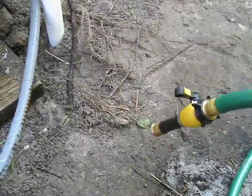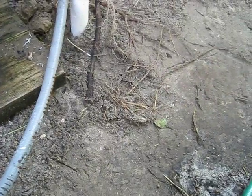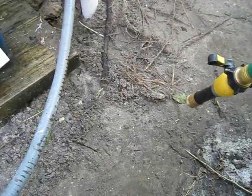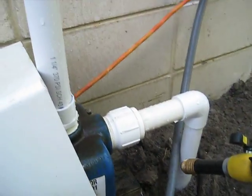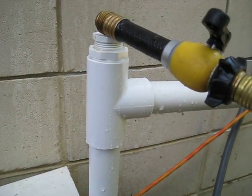This is the input that comes from the well. Right about here we have a check valve whose purpose is to hold the water from the well all the way up to this point without letting it run back down every time the pump turns off. So each time we turn the pump on, the distance it has to pull the water is only from here to here, which results in the water coming on right away.